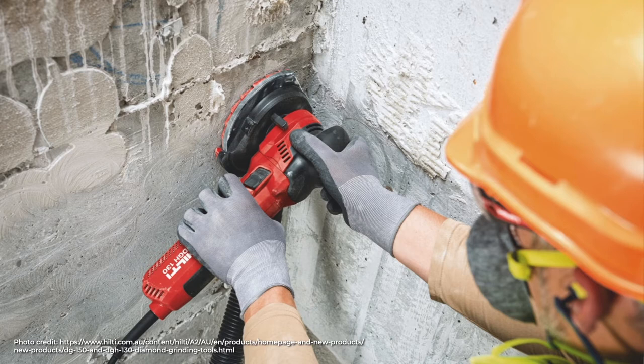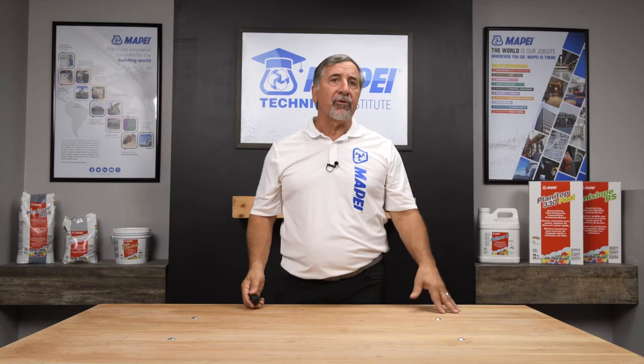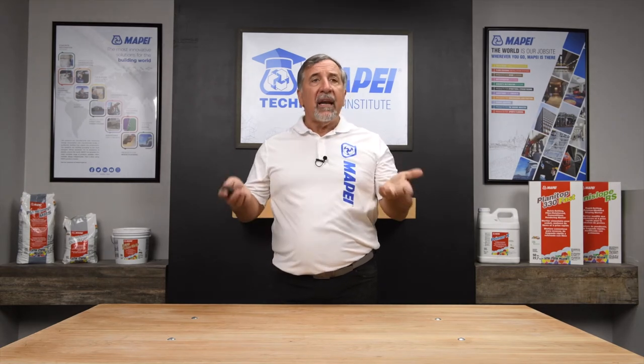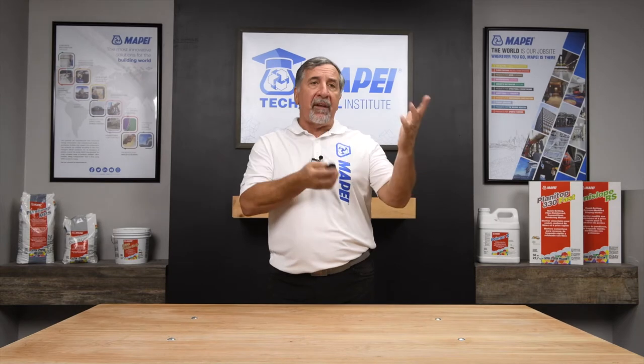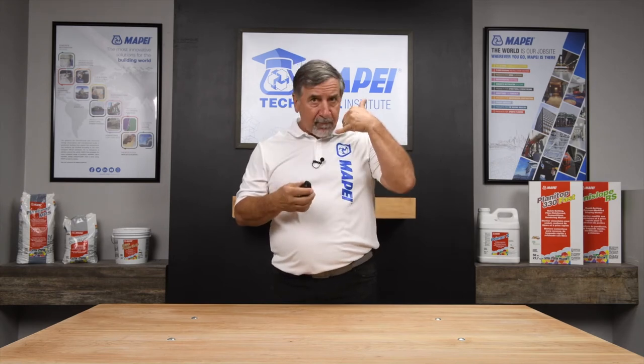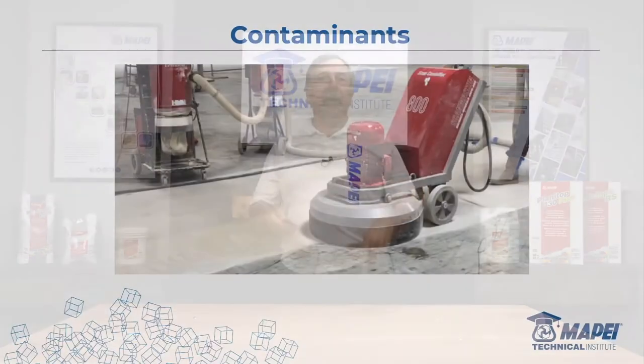I like this picture because if you look carefully, that looks like somebody used the five blob method, put tile up on a wall, and it fell down — you can see the efflorescence dripping down on the left-hand side. Now he's going to grind the wall flat and start all over again. Don't do that. Use the proper mortar and proper technique. The TCNA puts out a handbook every two years with every known method that works. We connect our 3D CAD drawings based on their methodology and substitute our products into the recommendations.